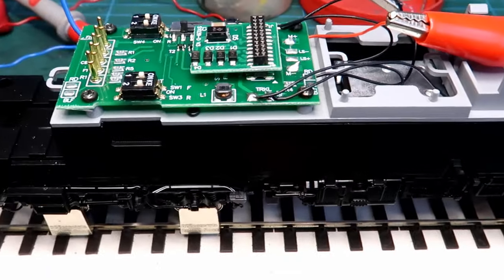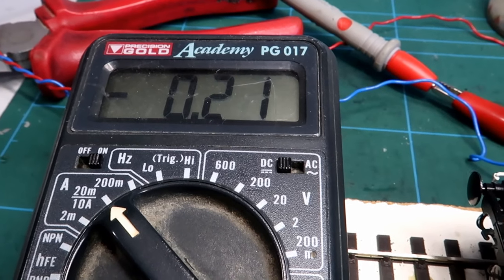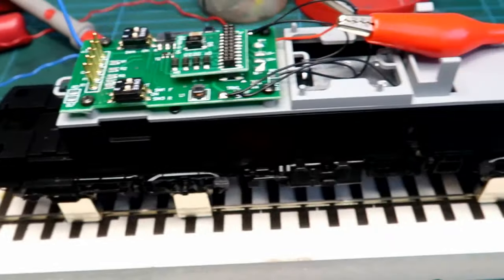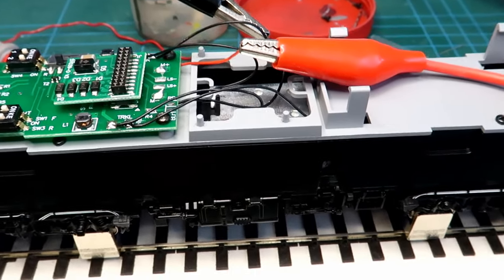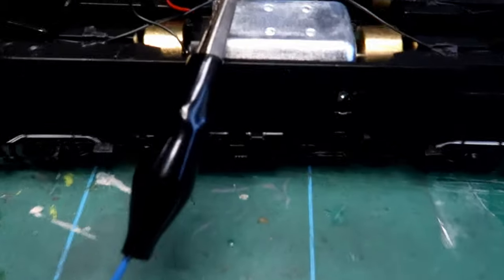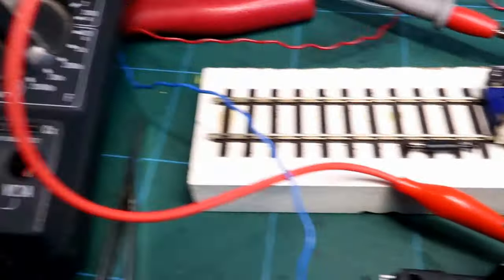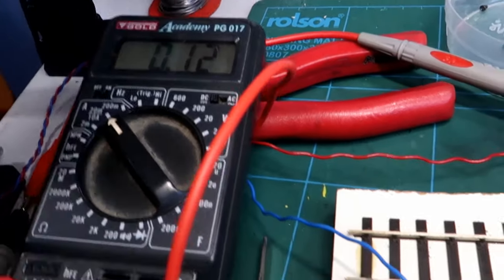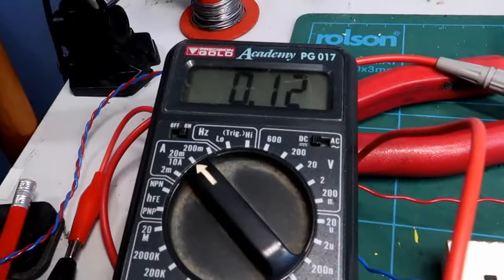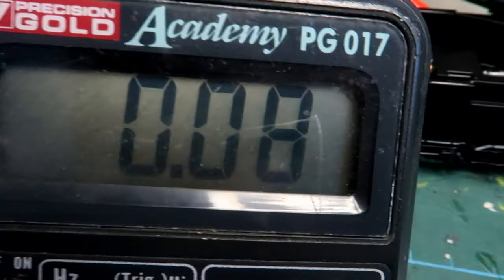My next objective is to take the motor out and isolate it. It's going there again — so we'll isolate the motor completely. Maybe not take it out but we'll certainly disconnect the gear chain. Now with the drive chain disconnected, the motor is just independent. Let's ramp the power up. There's quite a lot less current when it's not under load. How much load must that drive chain be putting on it? So we need to look at that.